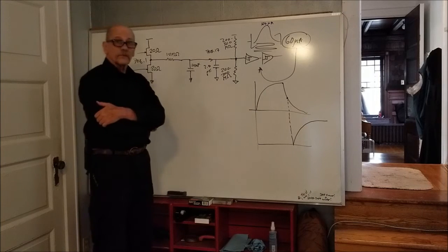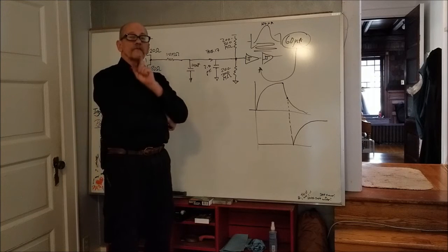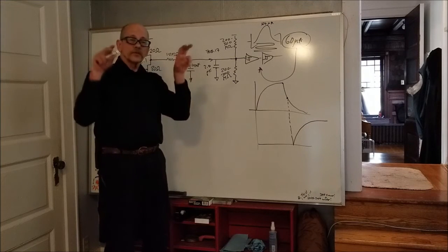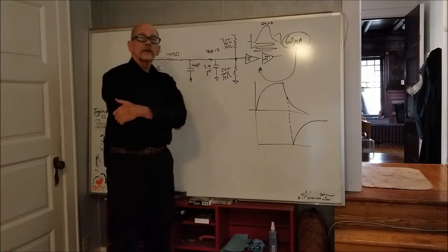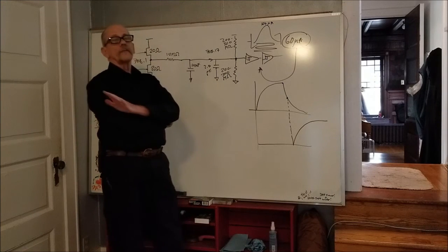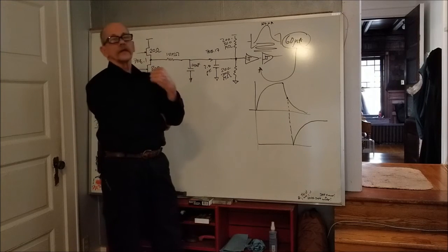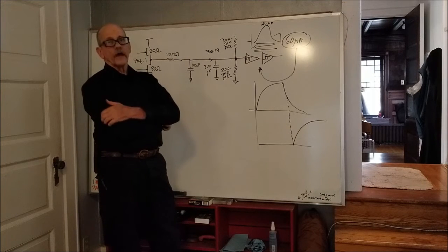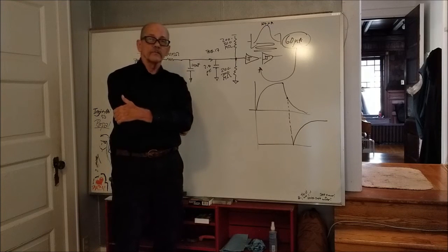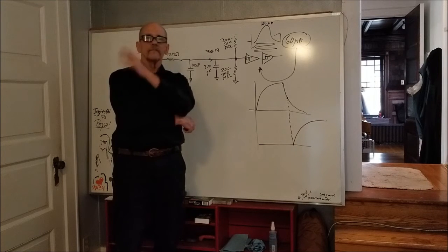So the next experiment that we'll do for low frequency stimulus for situational awareness is to see if it actually takes less energy to run an external CMOS timekeeping device. There's one we've identified that claims to run 100 nanoamps as being its claimed continuous power. We'll find out what it costs when it's actually stimulating us, and next year we'll document that just for laughs. It's certainly not going to be 100 nanoamps. That's not in the cards because it's going to cost it something to stimulate us, and of course they never brag about that in the data sheets.